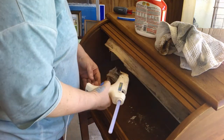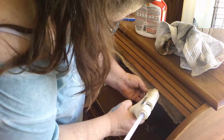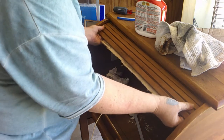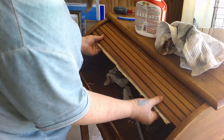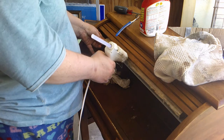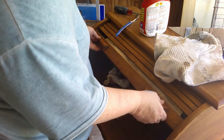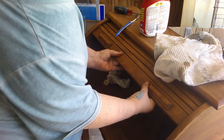Let's talk about roll tops. Roll tops are made up of individual slatted pieces, and this one was in three pieces. Sometimes they come in like 25 pieces — so I'm lucky. This one slat needed to be reattached, and this is actually in double time speed. You can see behind the slats is this piece of muslin — like a canvas, a pretty decent piece of material. You can replace that with any other decent piece of canvas if you need to. All I did was glue the slats back on using regular hot glue. You could use fabric hot glue or gorilla hot glue, but I just used regular because this desk isn't going to be used every day.